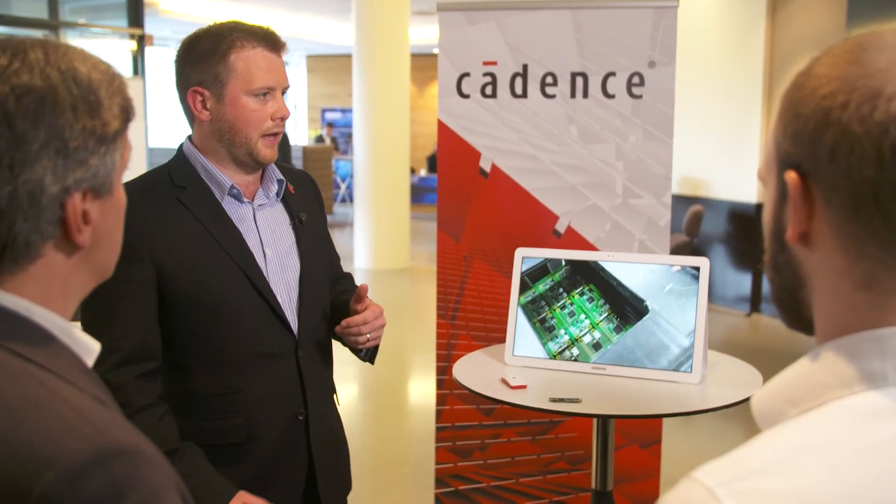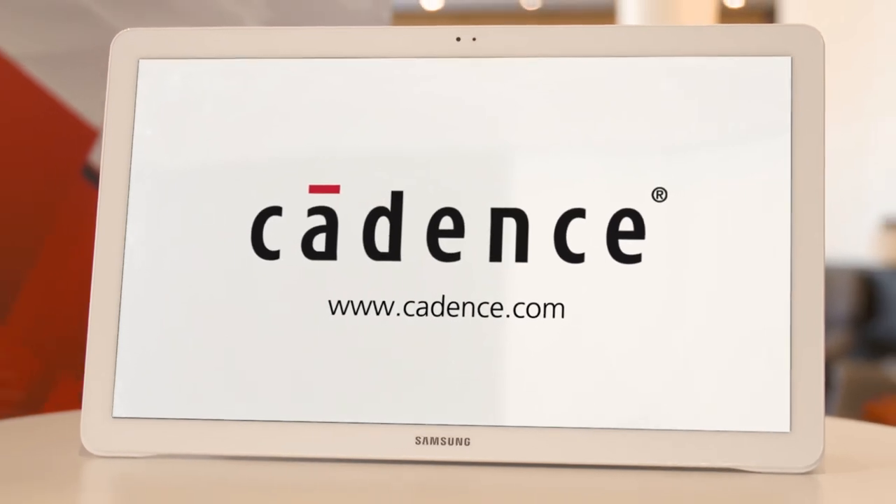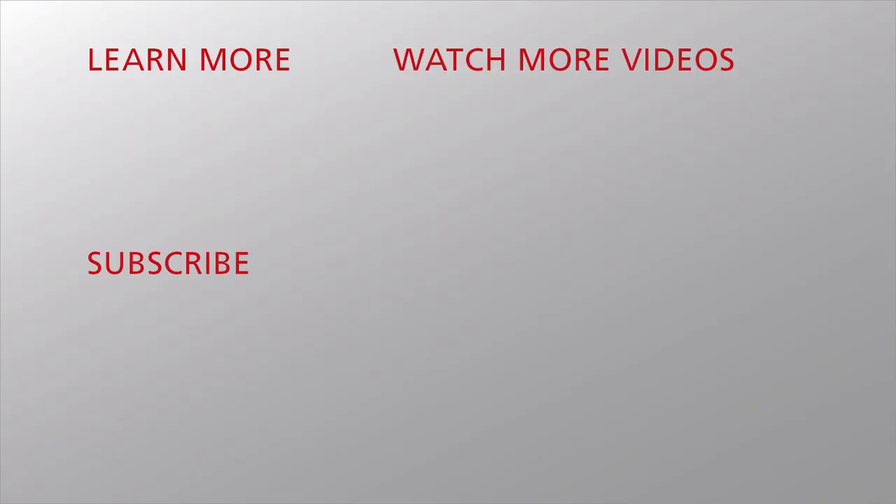The final thing to touch on is how the BOM is kept cheap: we have to keep it single-sided so that it only goes through surface mount manufacturing once. That added a whole new raft of headaches for routing, but it also means we can achieve the $10 price point. To summarize: Pi Zero W is a $10 PC — quite an impressive feat — but it's basic PCB technology built using powerful Cadence design tools, and it's that combination that means we can achieve these things. Without powerful software, we wouldn't be able to build cheap PCBs. Thank you for listening — Pi Zero W is on sale, so go out and buy one.